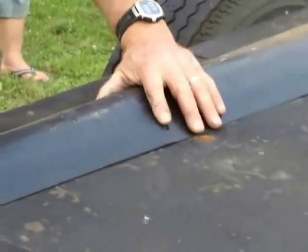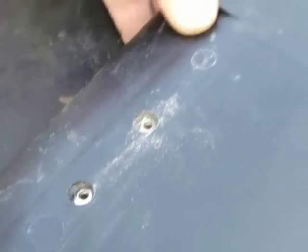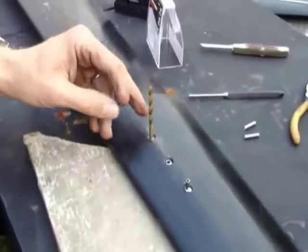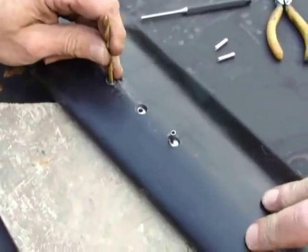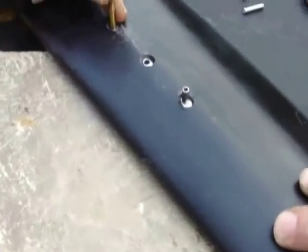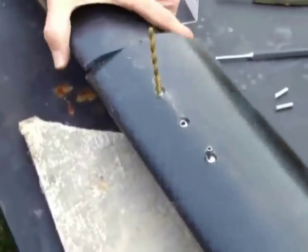Align the holes in the blade rod with the holes in the blade tip — can you push that in a little bit farther? There you go. Using a hammer, pound the first spring pin into the hole furthest from the inner blade. We want the roll pins and the pin punch that came with it. I'm using a drill bit to make the shaft line up while Keith drives the pin in — it all rotates, so nothing here has to be fixed in a specific orientation.